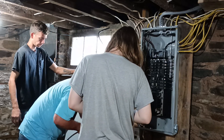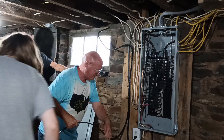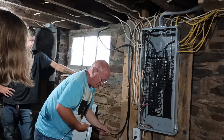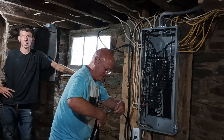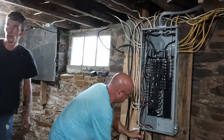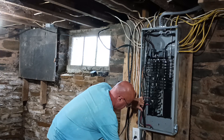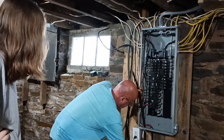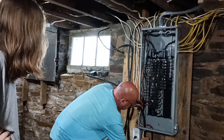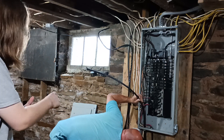So I'm popping it down and around here. I untwist — like I was telling you, Jake, to make sure it doesn't get twisted. That's why. I come up into my Romex connector here. Just make sure that you don't ever hit the inside of that box with a wire, metal, or anything, because it's live right now — the main is on.